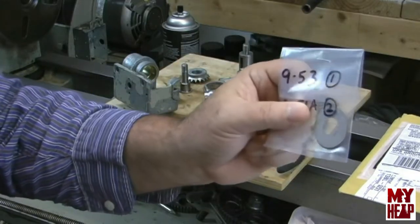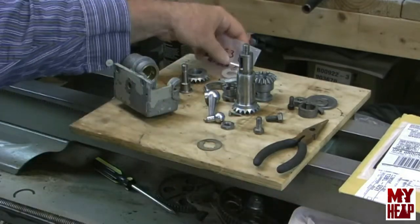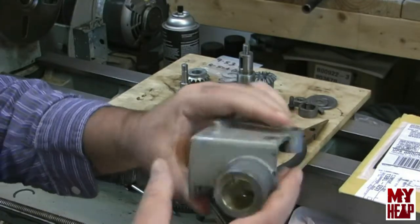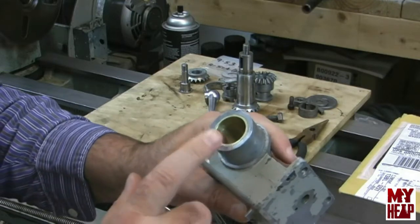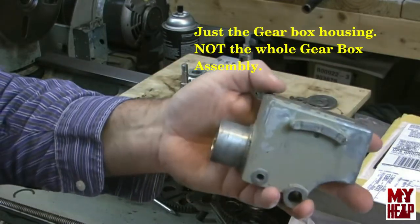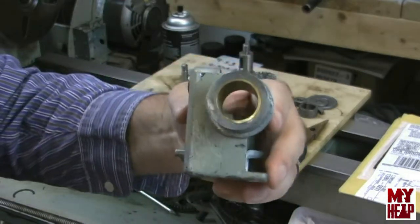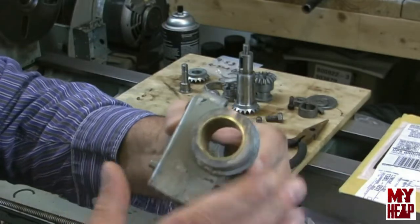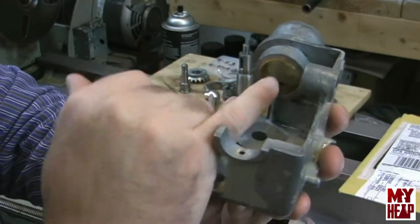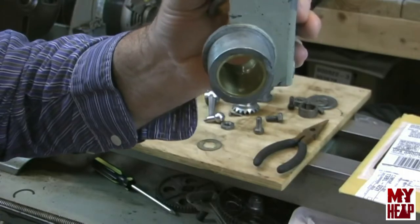So we have the fiber washers for the gearbox. The other thing I want to talk about: if you recall from the last video, I said the bushing on the end was wallowed out pretty bad. I called Clausing about this bushing — it's not a replaceable part from Clausing. You actually have to buy the whole gearbox assembly, and that's 75 bucks. So my friend Gary Johnson, who's a machinist, was kind enough to take this, put it on the mill, bore the old bushing out, make a new bushing, and press it back in. He drilled the hole for the oil port, cut the oil groove, and cut a shallow groove in the bottom for the oil to reach the lead screw.